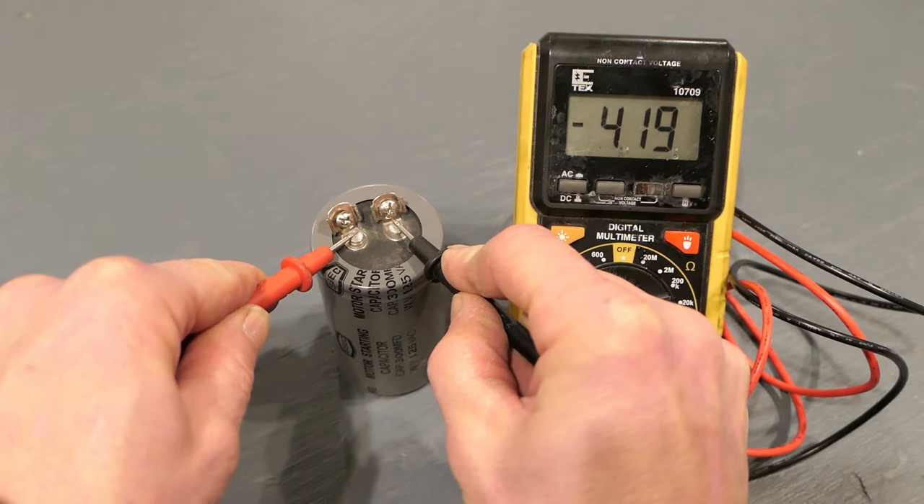In my case we were talking about a dust collector in a shop, but these capacitors are found in a lot of places in your home as well. A very common one is your air conditioning — if you have central air, your outdoor condenser has a compressor with a capacitor, and those are pretty commonly found in a failure mode. I know I've replaced mine several times. Inside your house, if you have big forced air heat, there's a big squirrel cage motor that needs a starting capacitor to get going. So if you think you have a problem with a motor starting, you can do the simple ohm test with a regular meter, or if you have one with a farad scale, you can actually measure the capacitance, and you can also look to see if it's physically deformed.